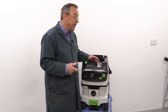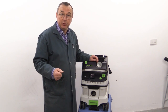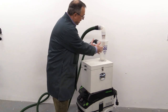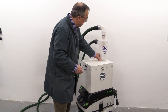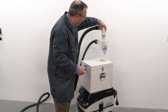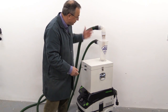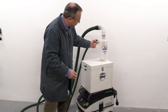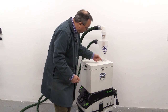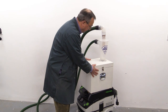But there's another solution, and about three years ago I bought a thing called a Dust Deputy from a company called Oneida which are based in the United States. A Dust Deputy is a cyclone — this is my old one here — and basically it's connected to the vacuum at the top and your tools are connected through this tube at the side. As the air is sucked out, the dust and debris comes into the cyclone, whizzes around and then goes all the way down into this drop box where the dust resides.